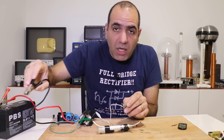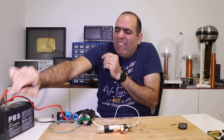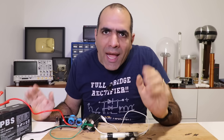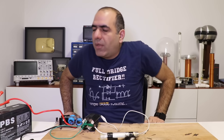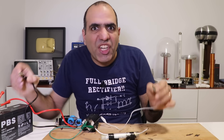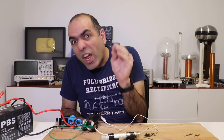And I should be able to charge it using my circuit. Clearly I haven't learned my lesson. Damn it. Burn my skin too? Handling high voltage is very dangerous and can easily kill you if you don't have a horseshoe up your butt! Maybe that's why I can't sit comfortably. Don't hold high voltage output while holding the ground — all your muscles will contract! It feels like you're hit by a truck! Be disconnected from everywhere and if you have to, touch the circuit with only one hand.